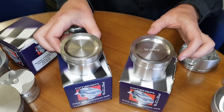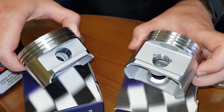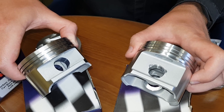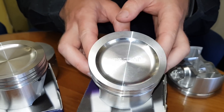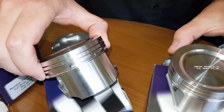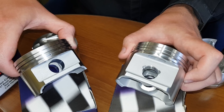So that's the piston 90% complete now, from the billet of aluminium to the final stage. You'll see the slight visual differences between this one that's just been machined and the completed piston — this one's a short compression height and that one's a standard compression height, but the machining itself is the same. It will need to be deburred between stages. The next process will be the gudgeon pin bore finally machined, with a groove for the retaining circlip and extraction holes. After that it will have engraving on the top — a part number, batch number, and a little F for the front of the engine. Importantly, these pistons aren't round — they're oval. That will be the next process: turning from a near-round shape to an oval shape, and that's where it gets really accurate with the machining. We'll come back to that next time.